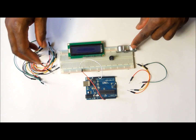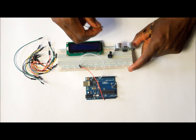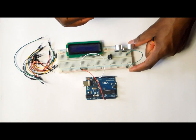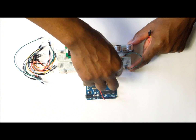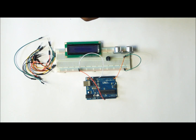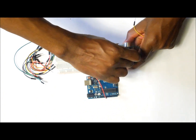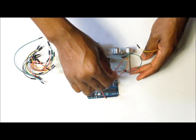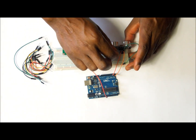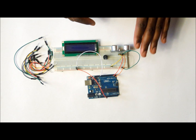The next thing we want to do is wire the ultrasonic sensor already on the breadboard. You are going to need four wires. The first one will go from pin VCC on the ultrasonic sensor to the positive rail of the breadboard. The next one will be from pin TRIG on the sensor to digital pin number two on the Arduino. The next one will be the echo pin — insert a wire from the echo pin to pin number three on the Arduino. Then put the last wire from GND on the ultrasonic sensor to the negative rail of the breadboard. This completes the wiring of the ultrasonic sensor.